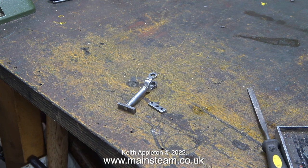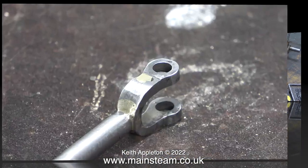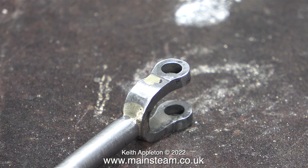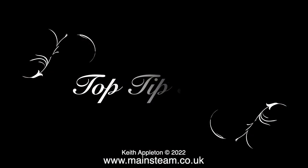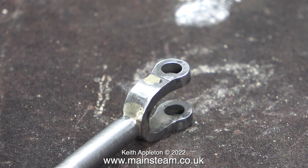I'm hoping this repair will be successful — I certainly think it will be. All I need to do now is throw away the horrible base part, the piece with the holes randomly drilled in it. The only problem though is the silver solder is not silver; it's actually a brass type colour. I think it's time for a top tip — it's top tip time. To get rid of this colour mismatch between the silver solder and the steel, there are a few things I could do. I could paint it, or I could electroplate it using silver.